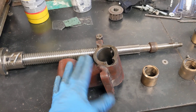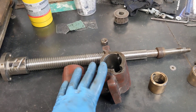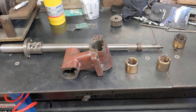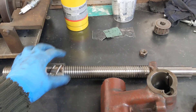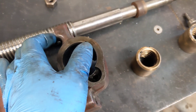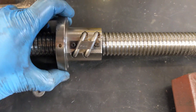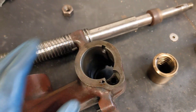There's a pair of nuts, one each side, adjusted together to minimize the backlash. The job I would need to do would be to put this into the Bridgeport, take the old pair of screws out, and put the new screws in with the new nuts. But that's easier said than done because the first thing to note is that the diameter of this is thicker than the hole in here — in fact it's quite a bit thicker — so if I was to bore that out there wouldn't be much meat left.